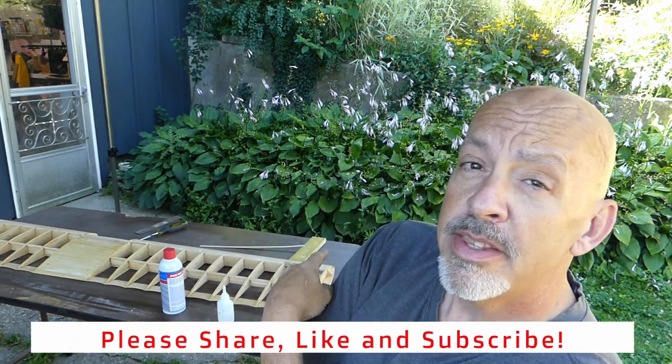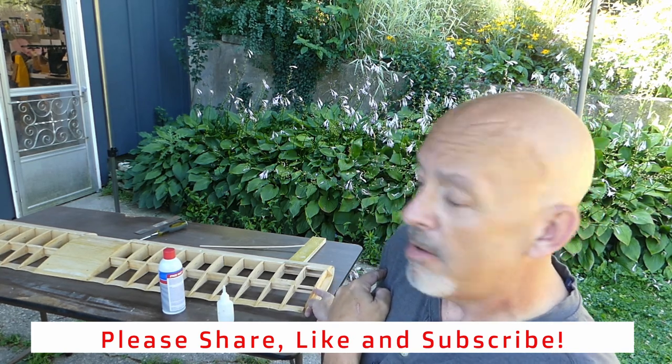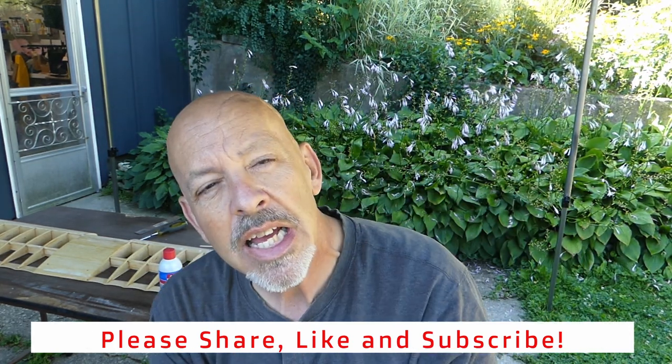Before we begin, I've got the bottom wing — I've got to go ahead and tear this little teeny rib cap off and replace it because there's a gap of about that big between the rib and the top. It was improperly done and I didn't see it until I got done putting dope all over that wing.